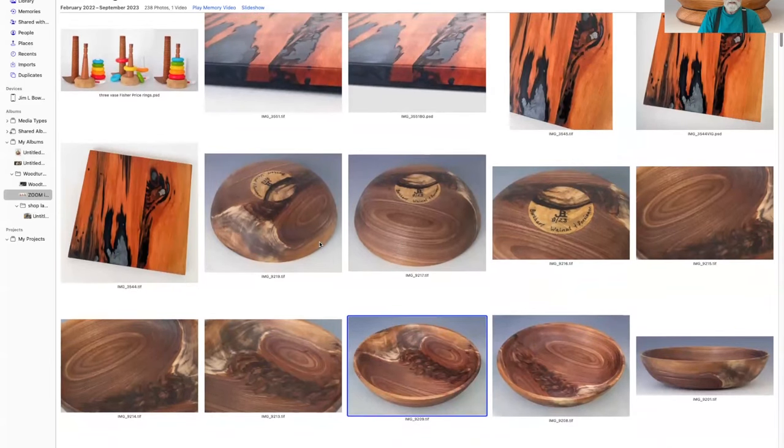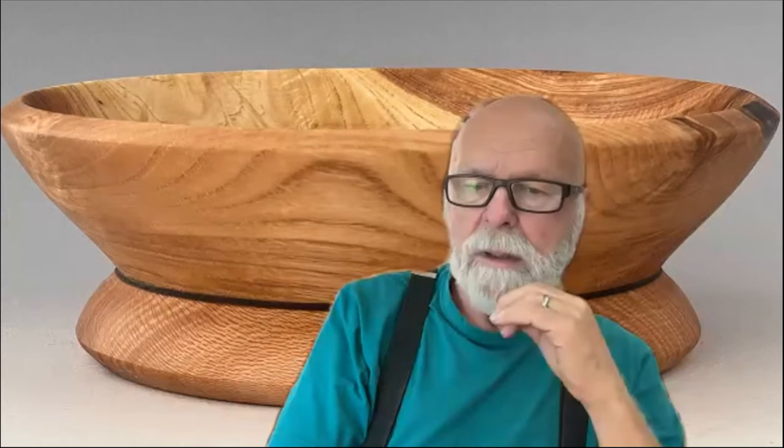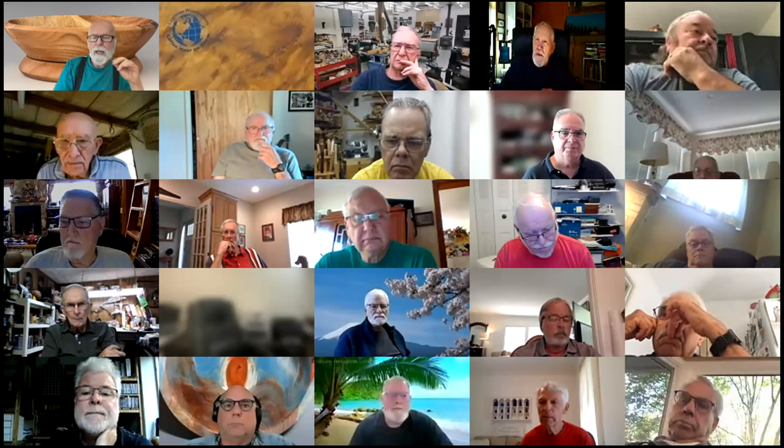Jim, just a comment. I turn a good bit of black walnut, and I find that it doesn't scrape very well. And I do my finish cut with high-speed steel, just an M2. Nothing above that. It tends to cut much cleaner. It'll dull quicker, but for a final cut, I find it gives me the best results. A gouge, right? Not a scraper. Correct. Okay.